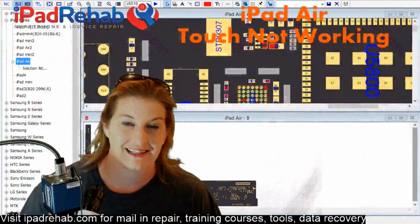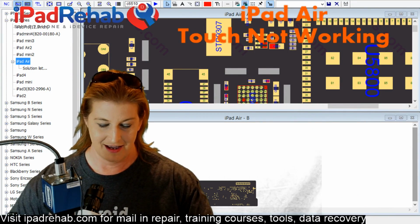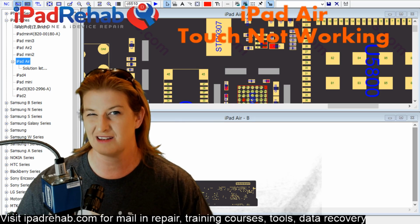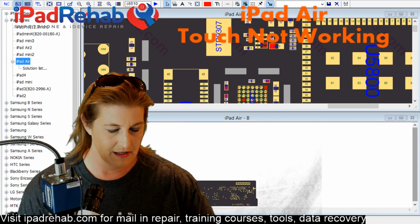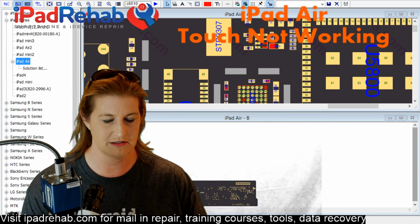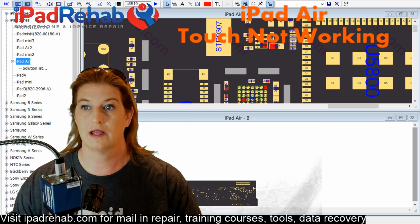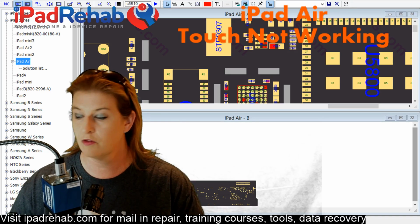So let's find that. I'm going to plug the iPad in so that I know for sure that the screen, I don't know why OBS keeps doing that. When I click away, it just decides to go on whatever scene it feels like. All right, so I'm going to plug it in to prompt it to wake up the screen. That way I'm ruling out, hey, what if I'm not getting a voltage because the screen is simply asleep and maybe it shuts down power voltages when it's sleeping? I don't know. So we want to rule that out.